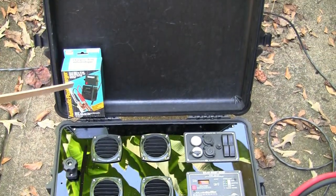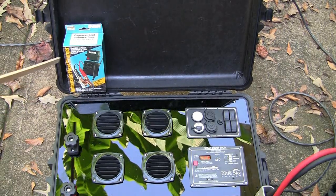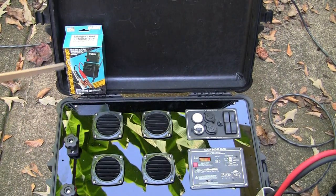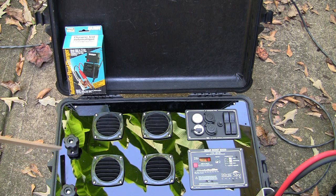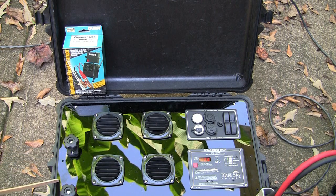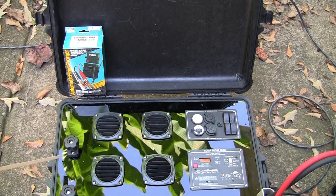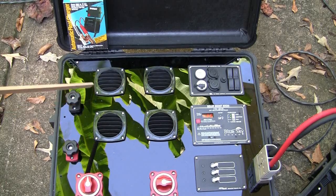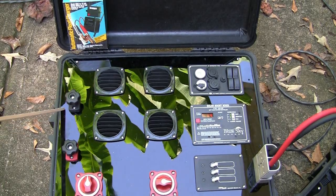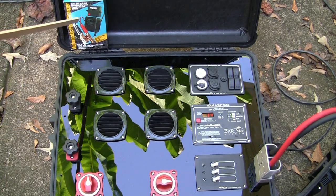And this is a little battery buddy. It's a trickle charger, or a float charger is what they call it. I grew up thinking of it as a trickle charger. It keeps your batteries charged up when they're not being energized by the solar panel. So if I have this sitting in my garage, just hanging out, the power that's stored in the batteries slowly degrades, so you want to make sure it doesn't degrade down too far. That's what the little float chargers are for.